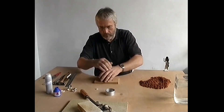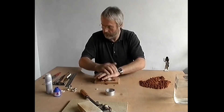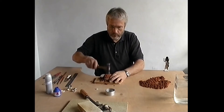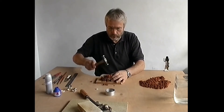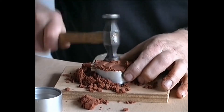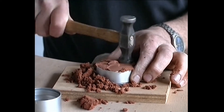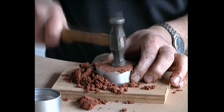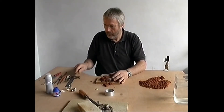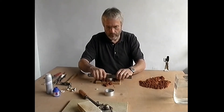A great advantage of the Delft casting clay is that your hands and tools don't get greasy. Make sure that all impurities are removed from the clay. In contrast to the previous mould, for this one we can compact the clay even more. Here we do not need to push the model halfway into the clay.